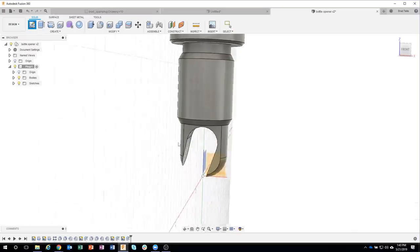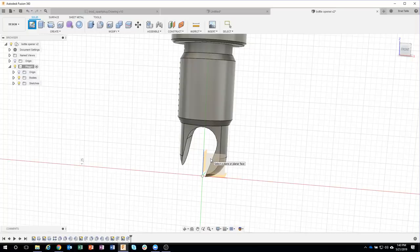So I'll say create a sketch. And I actually get this question a lot. I'm gonna switch to video here. How many sketches? Should I do one complex sketch with all of my stuff on there, or should I do a whole bunch of different sketches? Honestly, it's really up to you. I like to keep having, you know, multiple sketches. It keeps them simpler. If I had one sketch with all this geometry and all these dimensions, it can get kind of confusing. But I don't want to create a sketch for every single rectangle and every single circle. So just kind of do what makes the most sense. And you can kind of see how I'm breaking this down into smaller chunks.